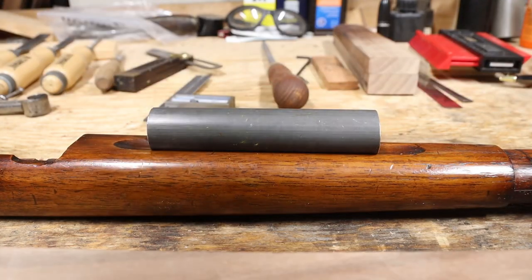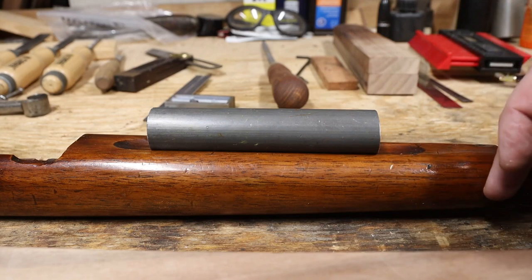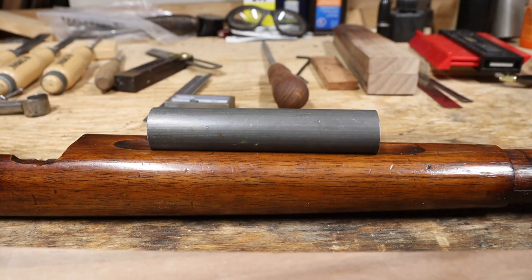So this is telling me that over the course of 8 inches, the front end of the stock needs to go about 50 thousandths lower than the rear. I could do trig to find the exact angle, but it doesn't matter because when I go to make my setup, I'll measure the same way.